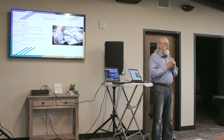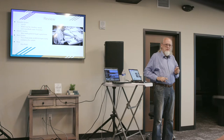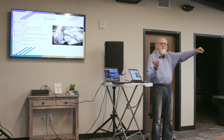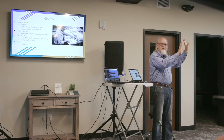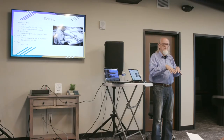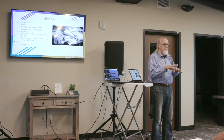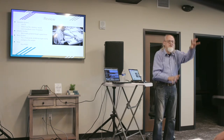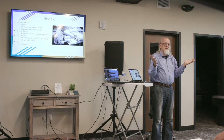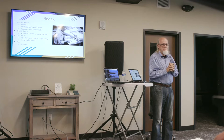So what he did to set the gain on any given channel was he put the fader at zero and then went to the preamplifier gain and just turned it up till we liked the level. And whatever it was is whatever it was. And it worked great. It was really amazing to see. Then he handed it over to me, and it was really a different mixing experience for me because I had to move the faders so much to get a change. I was used to being really careful. So a different way to do it. There is no one right way. And that's another lesson to be learned here.